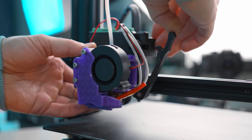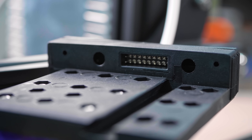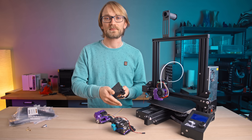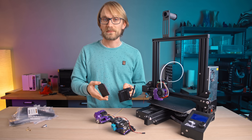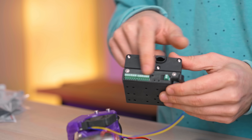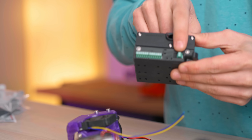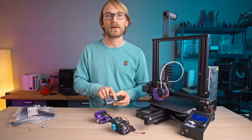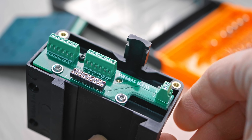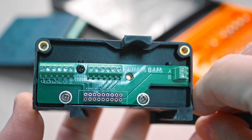The connector they're using for the electrical connection is a fairly standard pin-header type with a 2mm pitch, and those take a bit of force not just to plug in but also to separate again — if you've ever tried to pull apart a RAMPS and an Arduino Mega, you'll know exactly what I'm talking about. The official ratings for these terminals is 2.6A each for the 12 lower-rated contacts, and then 10A for the separate pair, which is interesting because the 2.6A terminals use one pin each on the pin header, but the 10A terminal uses three, which means it's actually pushing 3.3A per pin on the header.